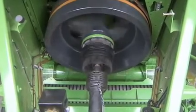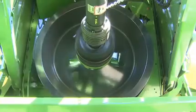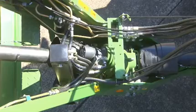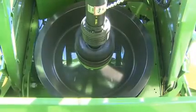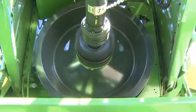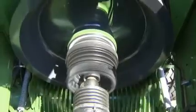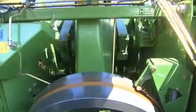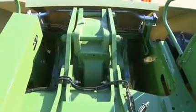The massive and more than 600 kilogram flywheel makes for quiet machine running. A right-angled gearbox takes care of good drive shaft alignment and increases the speed to 1,180 RPM for a more efficient use of the flywheel's inertia and hence a very smooth operation. The massive and easy-running bevel gearbox transmits the power at great efficiency.